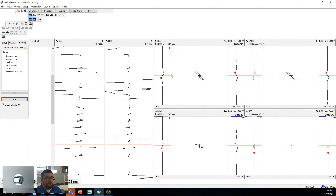My hole now, which used to be at 40 on the dot, I rescanned. Every scan's a little bit different. You scan a bit faster, the wobble, there's always a bit of variation, which is why it's important as an inspector to understand this. You're at 43.1, you can't say, oh, this is 90 some percent. First of all, if it is 90%, that tube is not looking very good. So you've got to be careful about that.